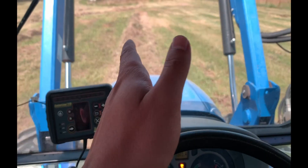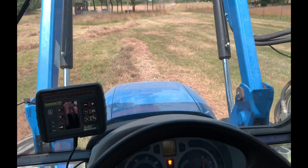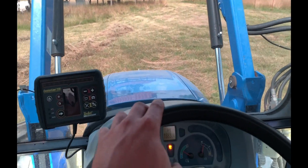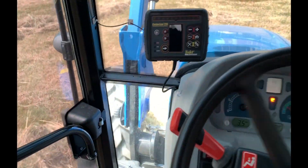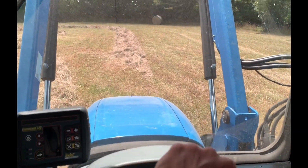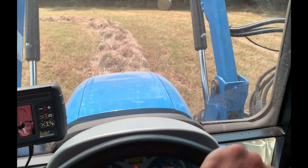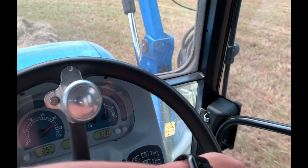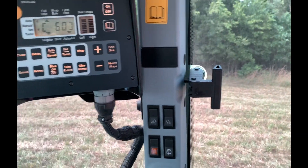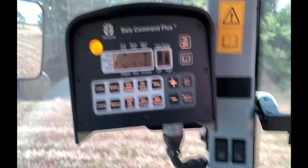I adjusted the total width of the rake — the amount of mower swaths it picks up. Now I think it's picking up about 30 feet at the front, maybe 25. So it's picking up a little bit more hay now. This looks decent but it's actually pretty thin hay — the rake is just picking up so much that it looks fuller. So far it's working good — it's beeping at 60 and wrapping the bales like it's supposed to.